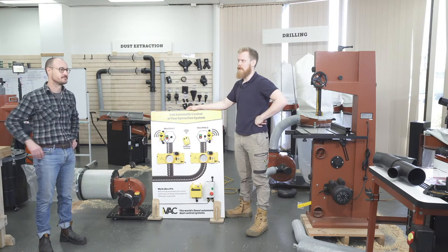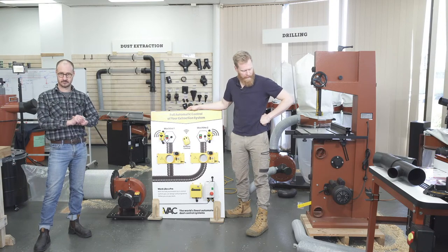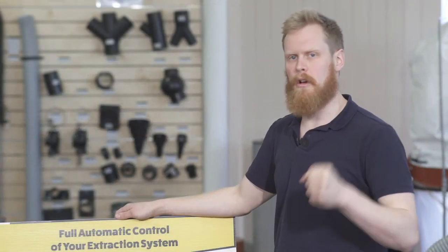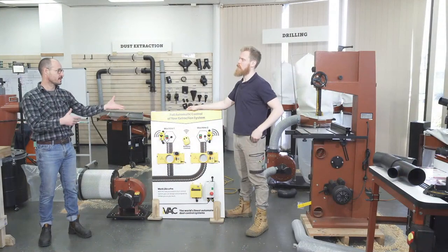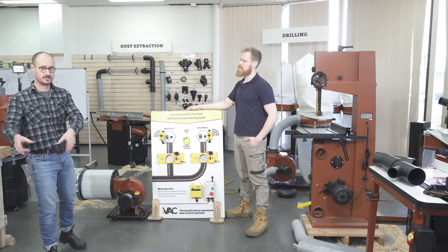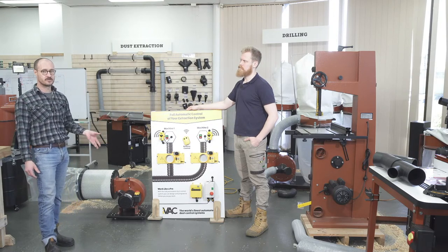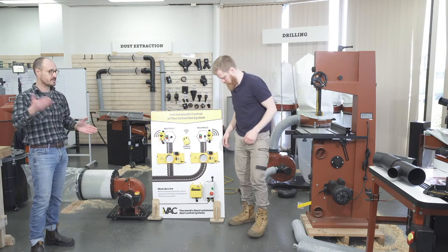We wanted to talk to you now about the iVac system. As you saw, once we put all of our stuff together, you're essentially walking around, turning on your dust extractor, opening and closing all of your blast gates to maximize your efficiency and drawing power. And you talk about standing there for ages machining, but some things you do, you're moving between one machine and the next as part of your process. Manually opening blast gates and closing them again is adding another step every time you do that.